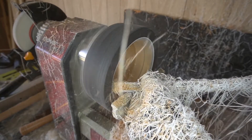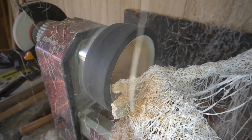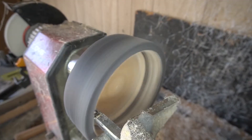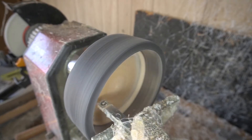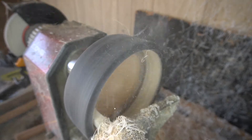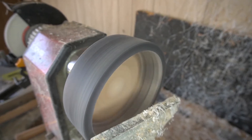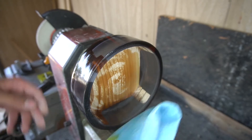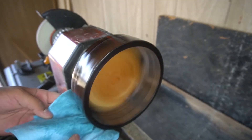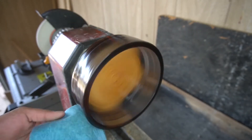My biggest fear is the fact that I'm going to chip out the side of the bowl and it's just going to be basically worthless. I wanted to do a very nice translucent look to it. The camera is getting shot with all of this stuff coming off the lathe. You can see where I flinched a little bit, and you can see the lines of the inner portions of the bowl. I'm getting a lot of different material between the wood and the epoxy, and it's just kicking back on me a little bit — it freaked me out and I really thought I was going to chip out the side. But got everything sanded down real good, then hit it with that wood wax and it looks freaking amazing. You can see the translucency in that epoxy — that nice dark black look, but translucent using the liquid dye versus the powder made it really, really cool.